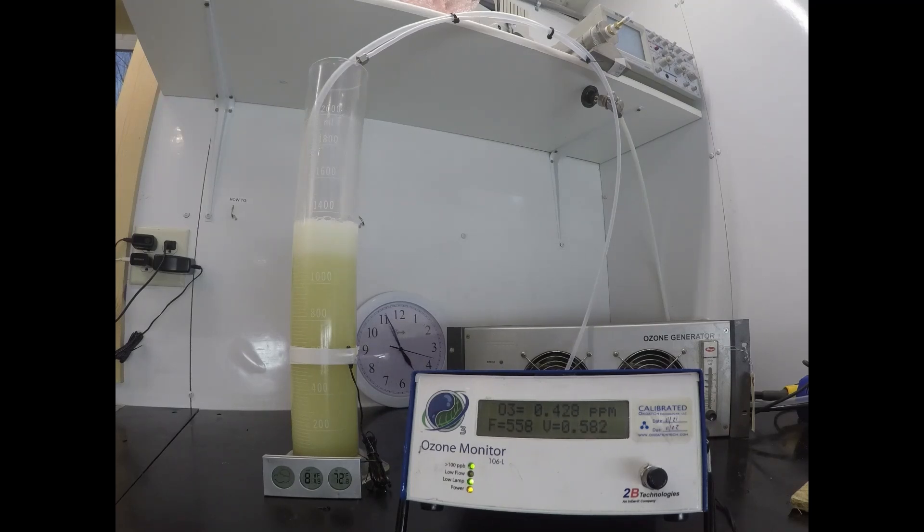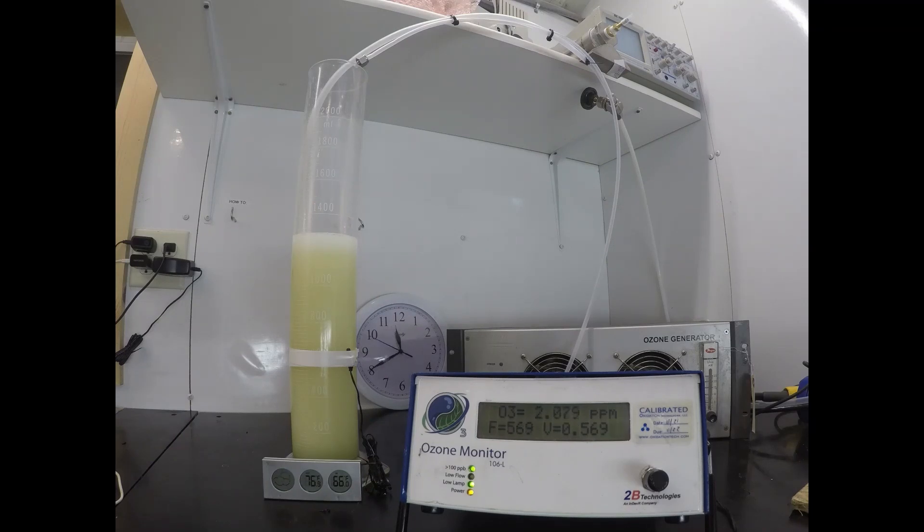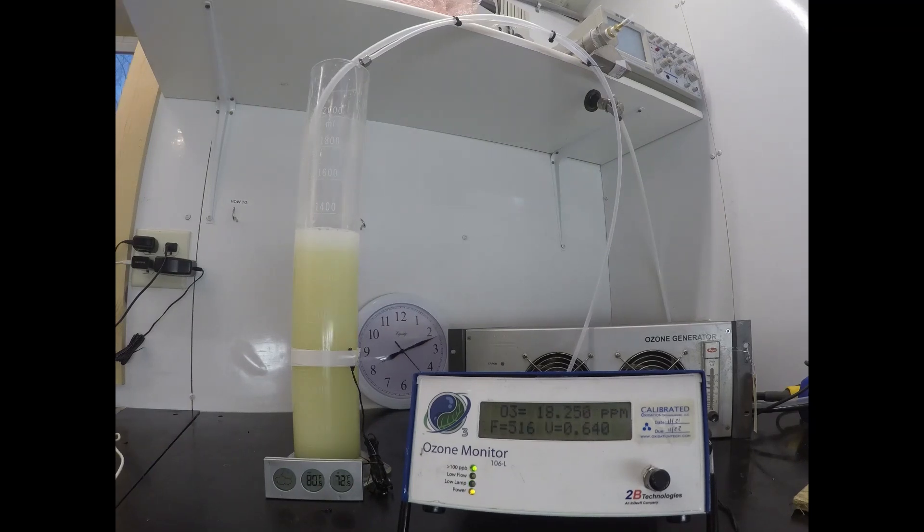That's why you see the ozone level on the UV-106M start to rise. You don't see it very high yet, but in a little while you'll see it around 200 to 500 ppm — it never really got there until the very end with oxygen, but with air we get there because the solubility is pretty low. That comes down to two reasons: number one, concentration of ozone is lower so solubility is lower; number two, air is less soluble into liquid than oxygen is. So when using air, overall we're less soluble, less ozone is dissolving, and we're making less — a lot of big differences.